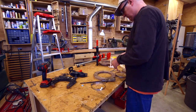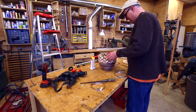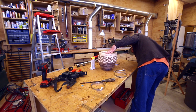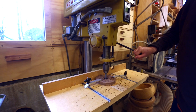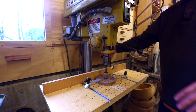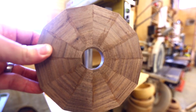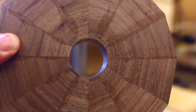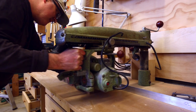Everything's dry and I can start stacking up the shape and get a feel for the bowl. It turned out a little bit tall with the rings I had, so I took one out. The second ring from the bottom hadn't come all the way to the center with the segments, and I was thinking that piece was probably going to be the bottom of the bowl, so I drilled out the center so it'd be nice and round, and made a plug on the lathe to fit into that circle.